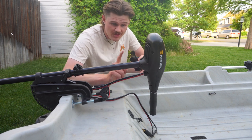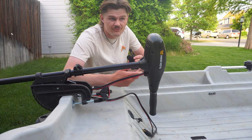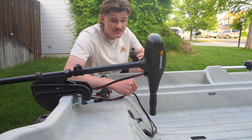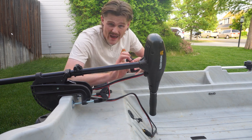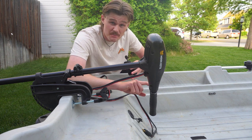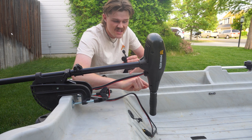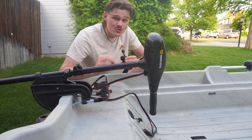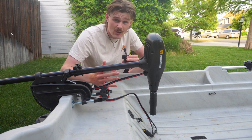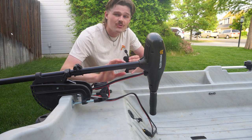Now for the last two mods, which in my opinion are the most important parts of this boat. Before, I had a 36-pound thrust Minn Kota Endura trolling motor on the front, and either the rudder or a two-stroke motor on the back. The two-stroke was a hassle — I had to take the boat on and off my car every single time, and the motor made my whole Subaru Forester smell like gasoline. So I've upgraded to a 50-pound thrust Endura Max. I picked the Max because it has variable speeds. The standard Endura has five fixed speeds, but with this one it goes from 10 all the way to 100 so you can fine-tune the speed. When you're trolling, a difference of 0.1 to 0.2 miles per hour can be all you need to get kokanee from lockjaw to firing on your rods. That variable speed is huge, and it's way more powerful — I'll probably get an extra two miles per hour compared to the old motor.